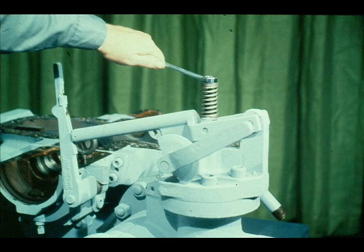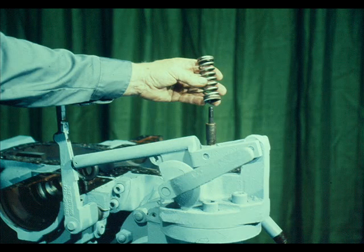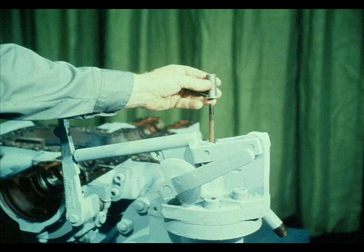After the spring and spring seats have been removed, the bushing is exposed and must also be removed from the valve stem. Now loosen the set screw which locks the anchor pin in the end of the resetting lever. After the set screw is loosened, the anchor pin can be tapped out of the lever, freeing it.